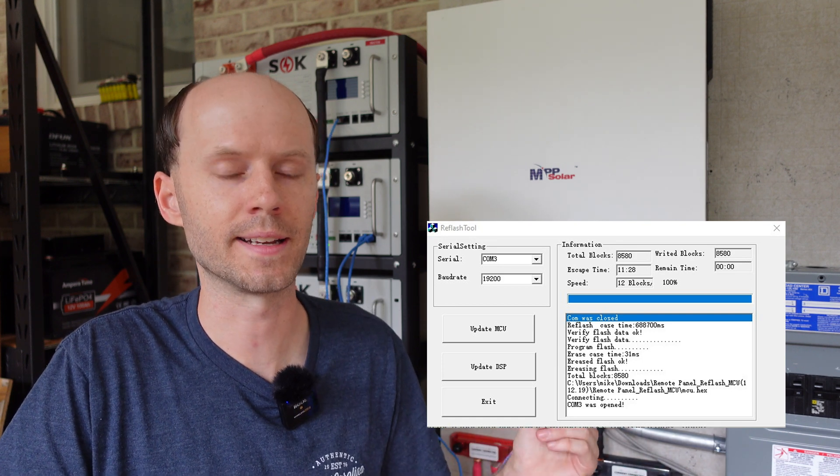The display works perfectly fine and I really don't even know what to say. I don't know if it's a hardware problem. I've flashed 12.13 on my other inverter with no problems whatsoever — I didn't have to do any ridiculous cooling, I simply plugged in the cable and flashed the firmware. Either this hardware is different, either it's faulty, or maybe they've got some kind of thermal protection to prevent people from flashing new firmware. I think faultiness is somewhat ruled out because many people seem to be having this problem. Meanwhile, a forum member directly sent me the official MPP firmware and I was able to compare the two files — the MPP firmware is the same as the OEM firmware. Same files, same checksum hash.